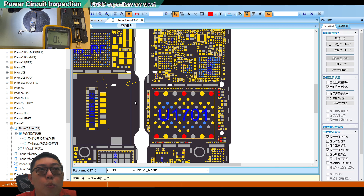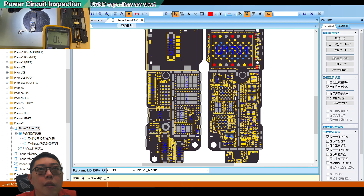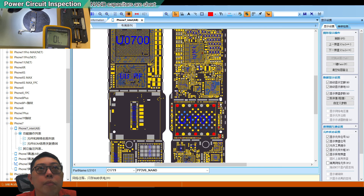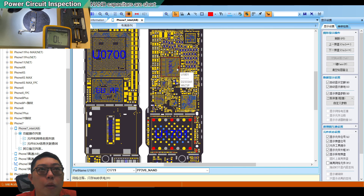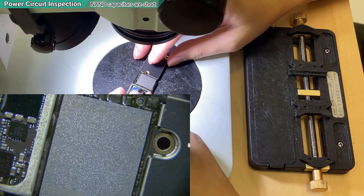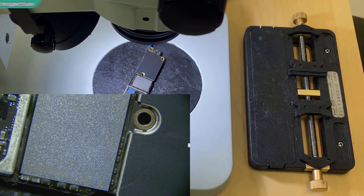These caps here are usually not getting heat unless you apply voltage directly to the line rather than from the battery. If you come from the battery, the voltage going through the power IC means the power IC heats up and then drops down - you're not hitting the actual problem location. I'll try with the thermal camera to see which one is the problem.